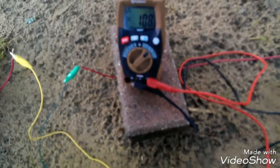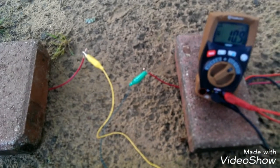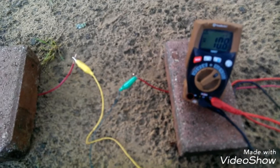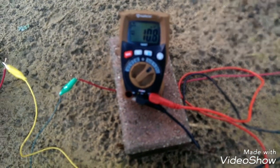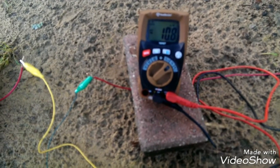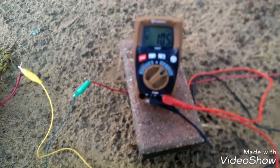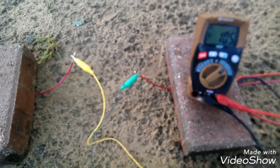As I was saying, we're already getting a reading — you can see the millivolts there. That's what we'll be measuring in: millivolts. The negative lead of the meter goes to the south probe, positive to the north. We're only going to read for a few seconds. Since it might be rapidly changing and fluctuating, we'll read for a few seconds and pick the average. I get a reading — it's 7 o'clock. I'm going to put down 11, because it was 11.1 millivolts. We'll be back at 7:15 for another reading.